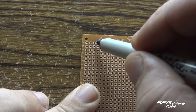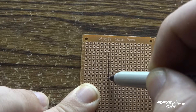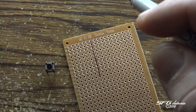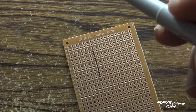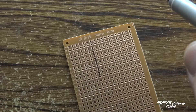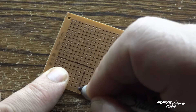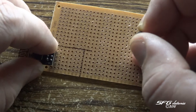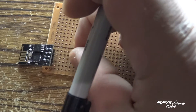So we're going to mark off one, two, three, four, five, six — just using a Sharpie here to mark it. I'm going to add a switch right onto it, so it'll just be a quick push of the button and it'll reset. It is a momentary contact switch that I salvaged out of an old CD player I'm taking apart. That size will be good enough — I'll be able to mount my ESP8266 and also have enough room for my switch.